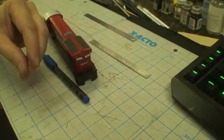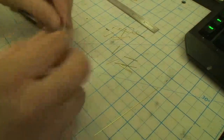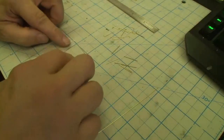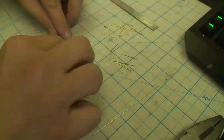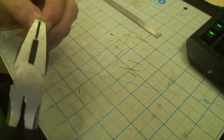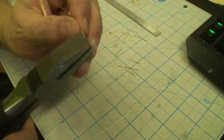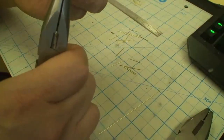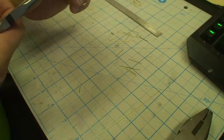Here's the thing — I don't like the way this turned out. It didn't turn out quite as good as I wanted but we've got the basic shape. What we want to do is lower it and straighten it out, and we're gonna do that on the cutting board with these lines so we can line it up a little bit better. First thing — let's undo the bottoms, shorten it. We'll take the lineman pliers and unbend it. One thing we want to be careful about is we do too much bending on this brass it gets weak.